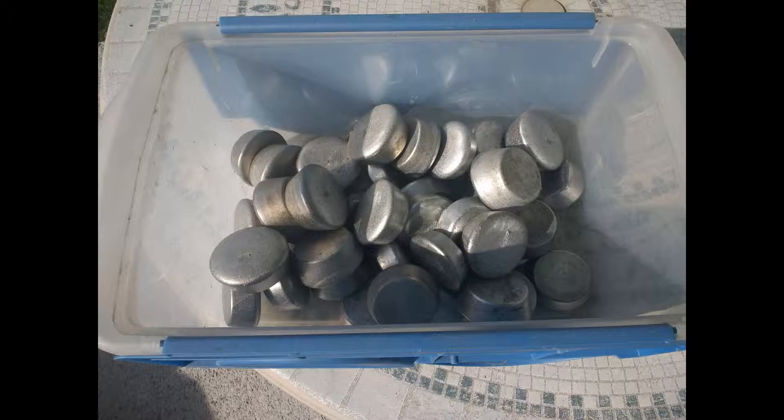With that said, there probably are some other metals in there that are not aluminum. So what I've been doing is casting each of my ingots in a different form factor. Muffins in this case are all hard drives — I think I mentioned that in a previous video as well — and this will allow me to make sure when I reuse these down the road I have a better idea of exactly what type of aluminum, or aluminum alloy in this case, that these drives are.